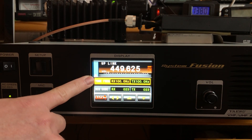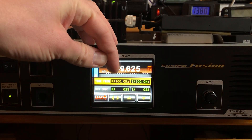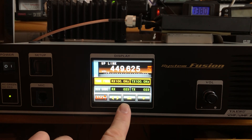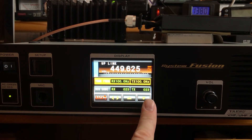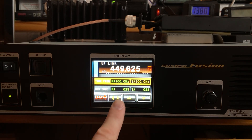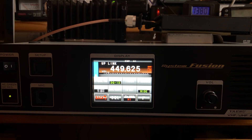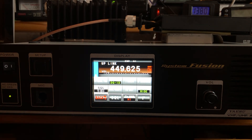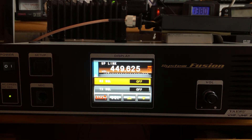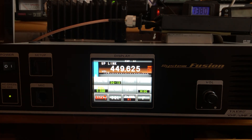In analog, let's keep it stock. You can change either setting — let's say it requires tone 100. You can see how items are highlighted yellow versus green on the top bar. To change the required input tone, go up or down. Toggle over to the transmit side — you have receive and transmit. We'll keep the tone requirement at 100. DCS is right below that. To set what the repeater looks for, go into the squelch menu: set receive and transmit squelch to tone.